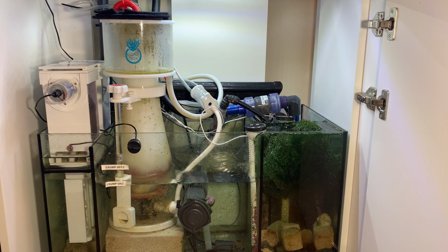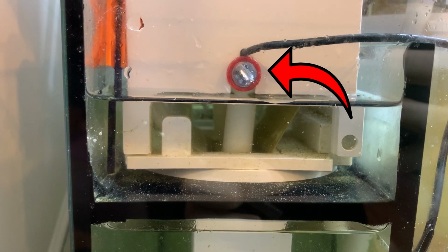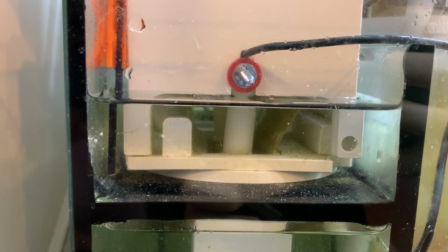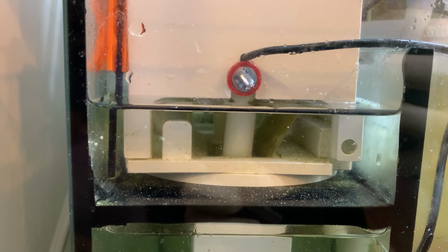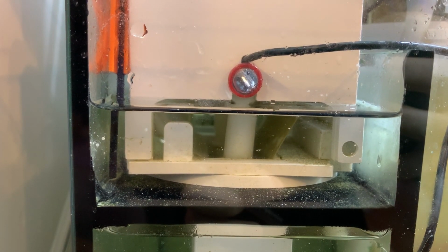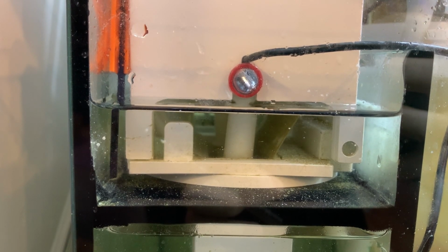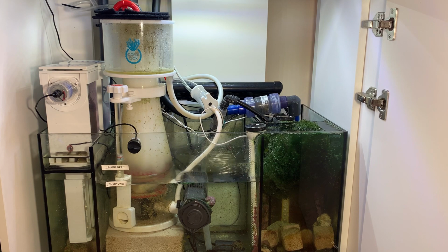They work pretty good. Once the water level hits this sensor here, it triggers the motor to run. I use a Y-split connector, which triggers both filter fleece rollers to activate the motor. So they both turn at the same time, so they'll both run out at the same time. From that chamber, it goes into my main chamber.